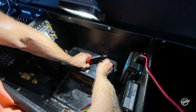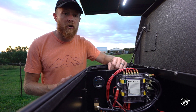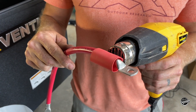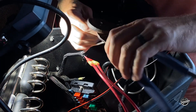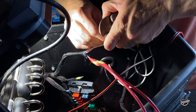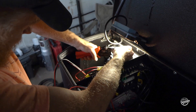With the Safety Hub, we run all Ancor marine grade wire with heat shrink ends, so we make sure we are as weatherproof as possible, and we try to be extensive and hand make each wire. With our marine grade wire and heat shrink, we use terminal ends that have glue and adhesive inside. As we heat that up, it actually helps keep moisture and other things out of the environment of that wire, keeping it better insulated for your use.